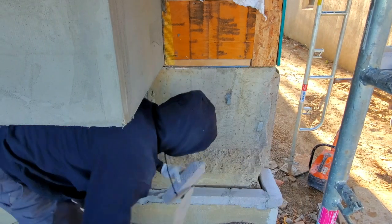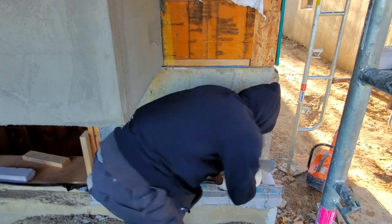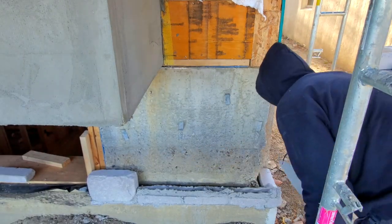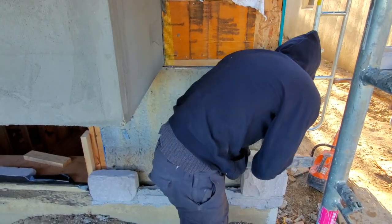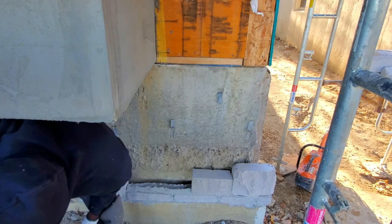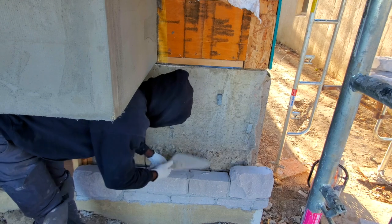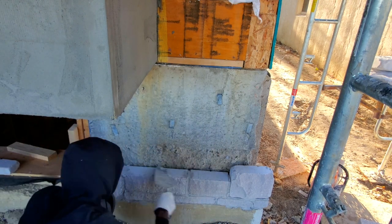It's a bit difficult to work right underneath here. As you see, the first course is probably one of the most important courses of all, so you want to take your extra time and make sure everything is nice and straight, plumb, and level. The cornerstone there — you want to make sure you plumb it and level it as you go up. We're going to put a few more courses and then put a line in the corner to use as a gauge and guide all the way up, so you can maintain a straight wall.